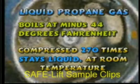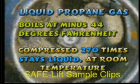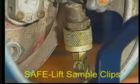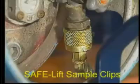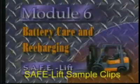Liquid propane gas is a liquid that normally boils at minus 44 degrees Fahrenheit. But when stored in a high-pressure cylinder and compressed 270 times, it stays liquid at room temperature. If released, the expanding gas can cause a serious frost burn when it comes in contact with unprotected skin. For this reason, eye protection and heavy gloves should always be used when handling.